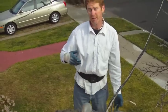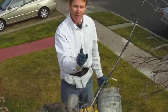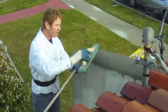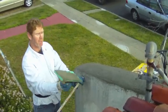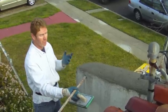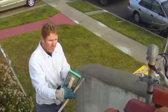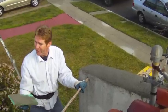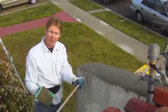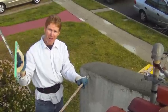A permanent fix would be to remove all this and re-wood it, but they're not going that route. Now I'm going to give this an arch and fish that tile back in, pack it with cement — we did find one good tile to use. Right now I'm just floating this out. It's a lot better idea than putting flashing, because that corner would look wicked even when painted. With another coat of paint when they paint the house, this will come out pretty good. They've asked about various cracks throughout the house — I said I'll do the cracks for nothing since I can't guarantee any of it anyway, with the roofs and parapets having seen better days.